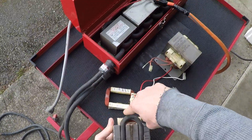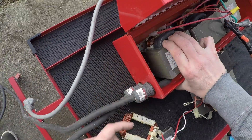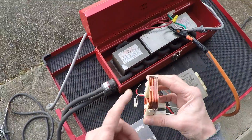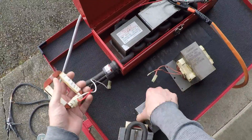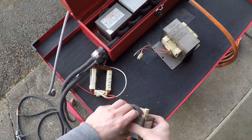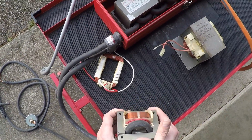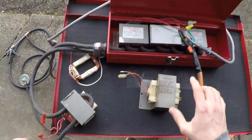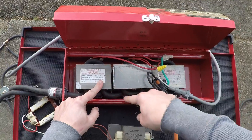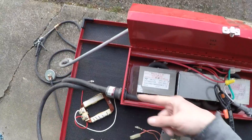After winding the wire in, there are two windings of thick wire in the housing. The thick wire coil pack goes on top, and then the lid goes back over it. It's a good idea to tack weld the plate back onto the housing on both sides — there must be no gap, it has to be nice and tight. I ran this wire, coiling it twice through one transformer, then into the second one — again a double coil — then a double coil into a third one. As the wire came out of the third transformer, it went straight out.